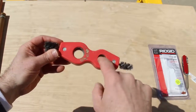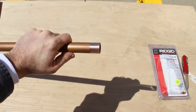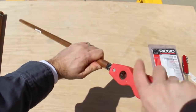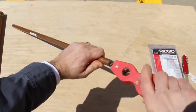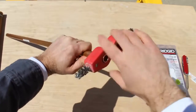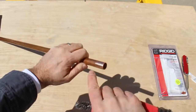When you're done, use this kind of wire brush—a copper pipe cleaning brush—which will clean the outside of the copper pipe. See how shiny it is? That's really important. And it'll also clean the inside of the copper pipe, which is equally important if you're going to be soldering. I highly recommend it because it serves dual action for cleaning both the outside and inside of the copper pipe. It's worth the money and it'll save you a ton of time by making your solder job really good.